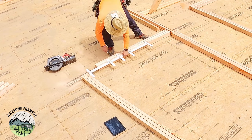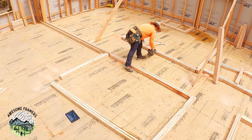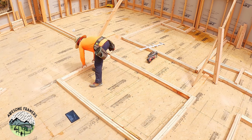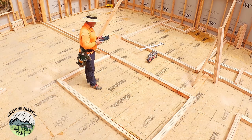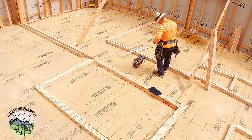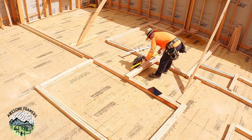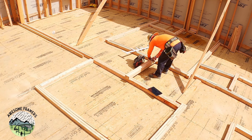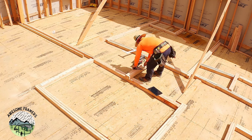If you have an apprentice make a mistake one time, he has to get on a ladder and rip that plate off, especially if it's an exterior wall, what's the point? We're using straps to connect our houses, the floors to each other, to hold downs, we strap collectors. Basically, we can't build houses without straps anymore because of seismic and hurricane requirements, so why not just extend the principle?